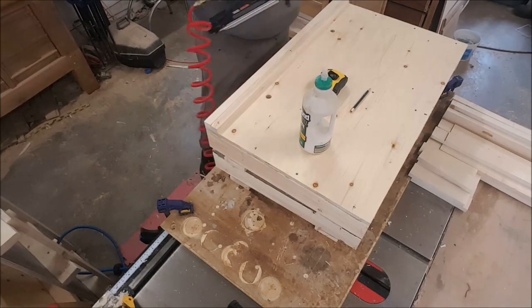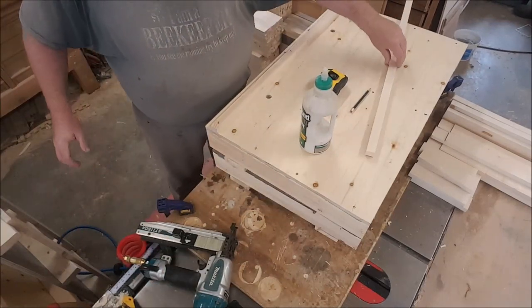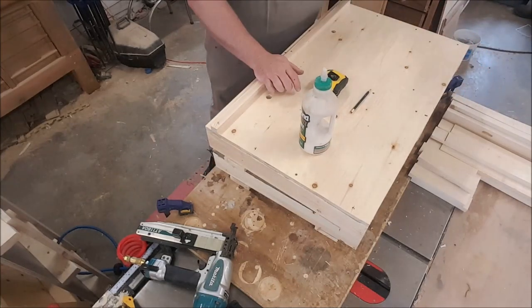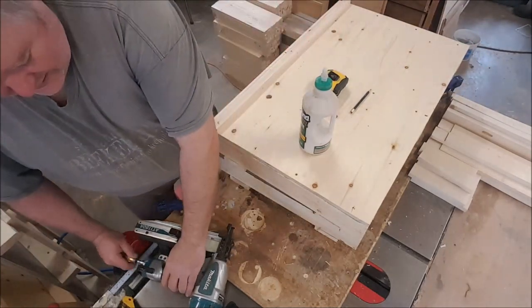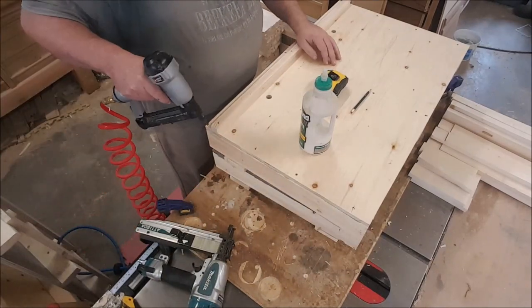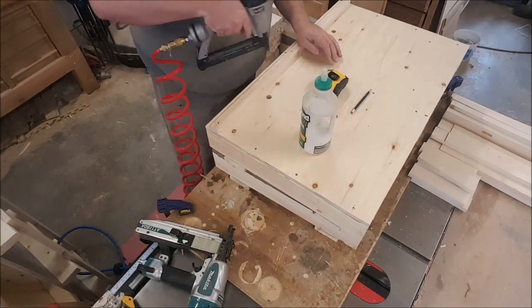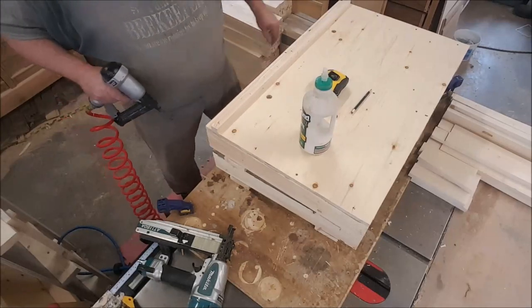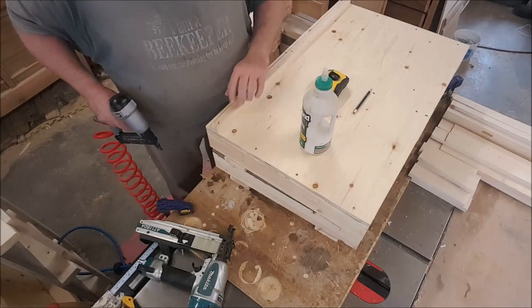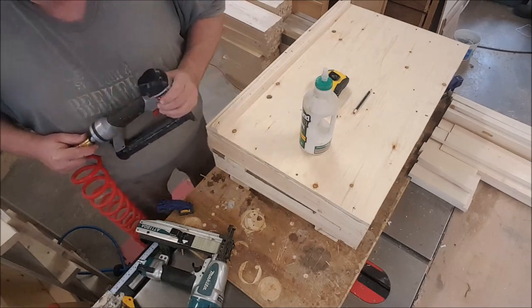Now, if you're doing the math, you know that staple is too long for the part plus the deck. The deck is 5/8. In this case, normally it's 3/4. In this case, it's 5/8. This one is a 1.25 inch narrow crown staple. And those don't come through. A few more in because they're not as big. These big medium crown staples are very substantial.